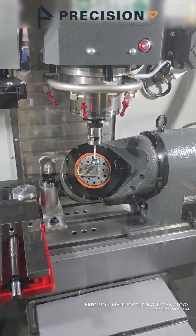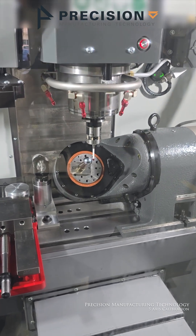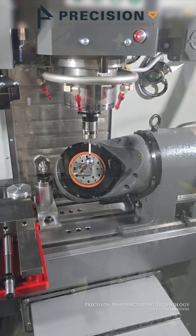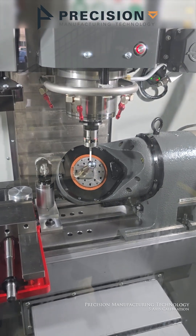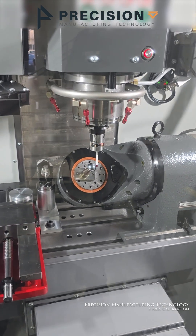It's tweaking so that automatically — you put a piece there and touch off on it while it's like this, find the center of it, and you're done. You can flip it anywhere you want and it knows where it is and where the tool is. That's your Dynamic Work Offset.